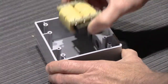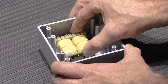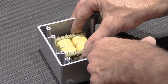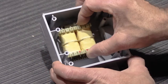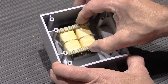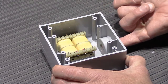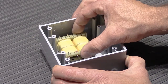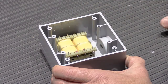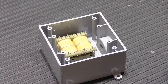The transformer is going to sit in the plastic box like this. The first step is to mount the transformer in the box. I'm going to offset it towards one end and away from the opening where the electrical wires will come in from the junction box — that's the high voltage side and I want more room there. To do this we need to drill some holes through the case for mounting screws.